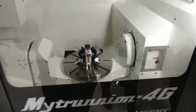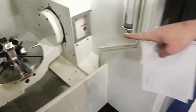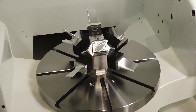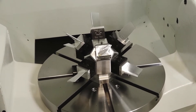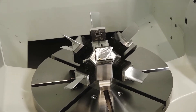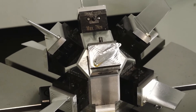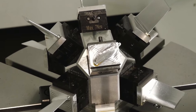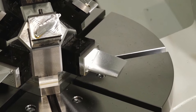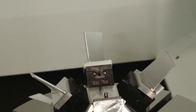Let's open the door — there are a couple of things I want to look at. Let's firstly look at this rather neat workholding solution here. Why have you done this and what is the reason behind it? The main reason we use this sort of workholding is that you can have multiple parts on it, and it gives you the ability to run the machine and produce more parts unmanned. There are many other solutions available in the market, but this gives you the flexibility to run the machine unmanned.